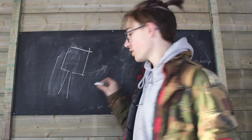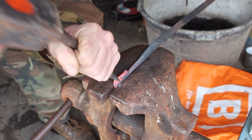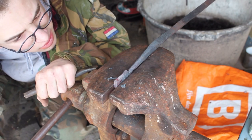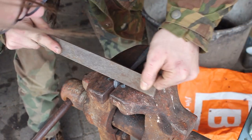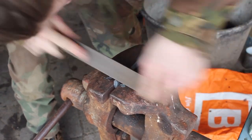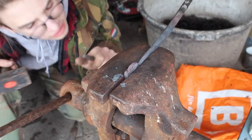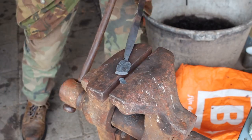For forging the ears, we put it in the leg vise like this. Then use a hot cut to cut a little notch right here. The next step is to file away all this excess material. We file it away with a file and we are left with a little ear. We do it on both sides so we have two little ears.